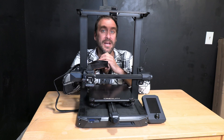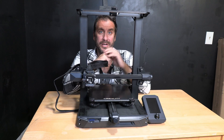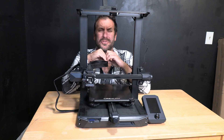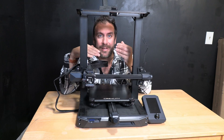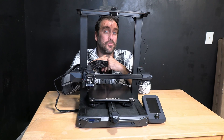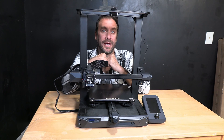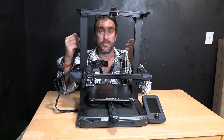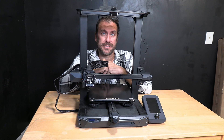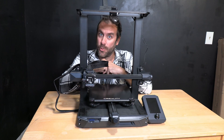And you'll probably have it completed and successful on your very first print. Something worth mentioning is that this is new glass — you may have one of two issues. Either trouble with adhesion: in that situation, sometimes glass beds require almost a bit of seasoning or breaking in. I clean it with IPA, I print, I clean it with IPA, I print, and over time it starts to work better and better. However, recently with newer glass beds I've been receiving, I'm finding the opposite — the glass bed's adhesion is excessively strong. You need to be really careful and take your time and be gentle removing the print from the bed, and over time it eases itself up a little bit while still holding strong enough for successful prints. So if you're someone who believes that glass is troublesome or difficult for bed adhesion, you might be pleasantly surprised to find out that it's quite the opposite with your new glass bed.